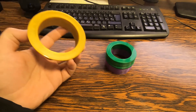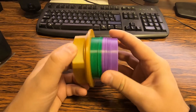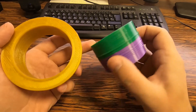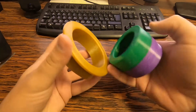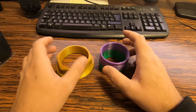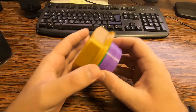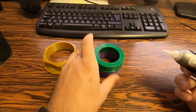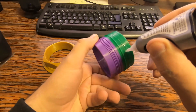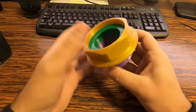This is the finished product. It's a twin piece assembly. It has this chamfered ridge here and it has a chamfer here, and it fits together like this. It is printed like this because it is easier to print without overhangs and other stuff, so it ends up as a better print. We just need to glue this piece to the other and you have a complete assembly.